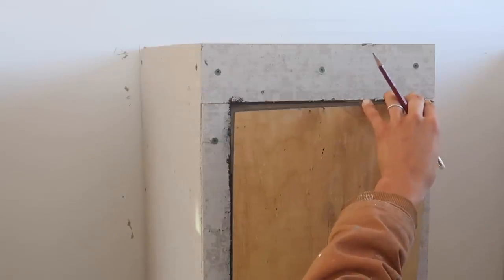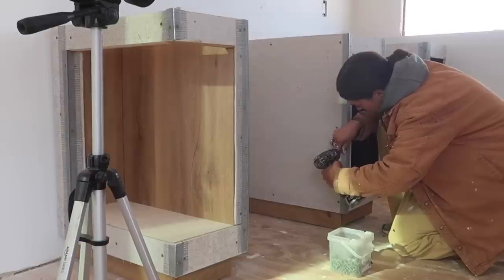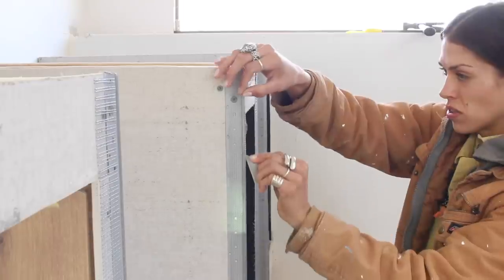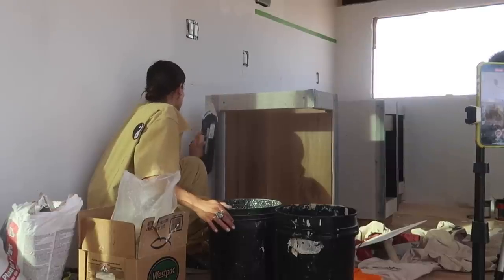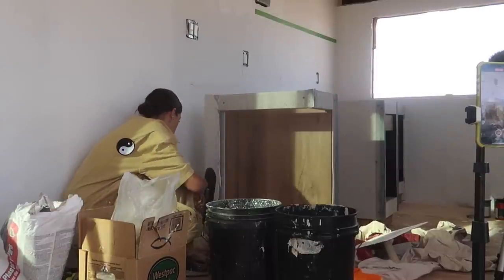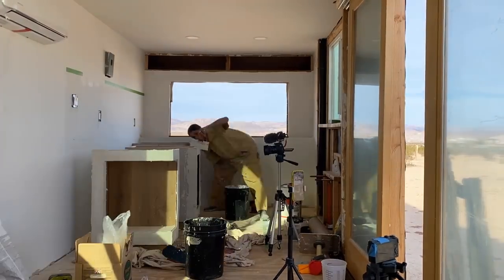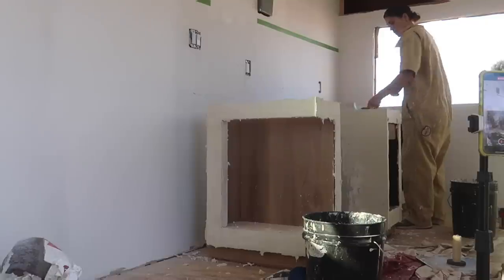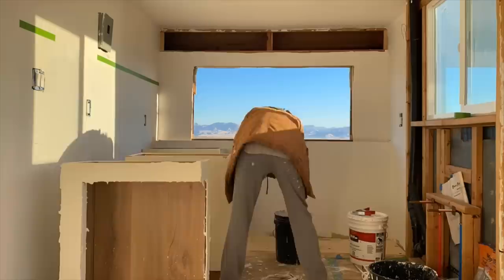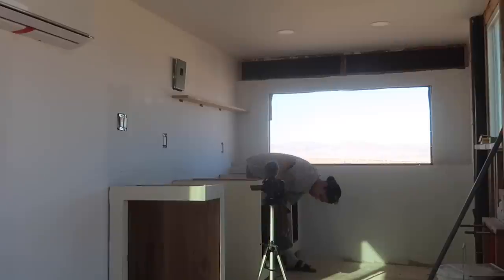After the drawer functioned, I popped a piece of plywood cut to the size of the opening to confirm I have the right size wood for doors later. Before that, I added metal edging to the hardy backer to make corners for these cabinets, then used fiber tape to blend the metal to the backer. Then we go in with this plaster — I did read the directions a million times, but I just didn't know how quick it actually dried. Within five seconds of mixing, it was hard as a rock. I had to remix it with my drill and water. Mixing little by little as recommended and using it within its drying time would have avoided the situation. When dry, a chisel lightly run across the straight edges cleaned it right up, and 320-grit sandpaper left these things ridiculously smooth.